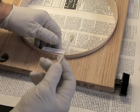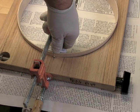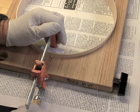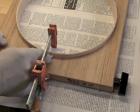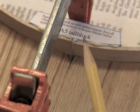Putting that block right on the center line, get ready with the clamp so you can squeeze it up and tighten it securely. We're really looking for some good squeeze out here — that's what's going to be important. It shows us that we have a good mating surface all the way along. Use a Q-tip to do some cleanup and get rid of some excess glue. We can see that the glue has evenly come up around that whole mating edge. It's very important.